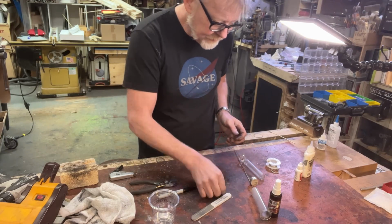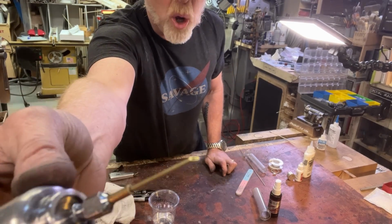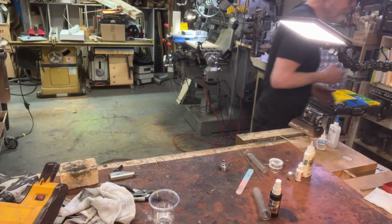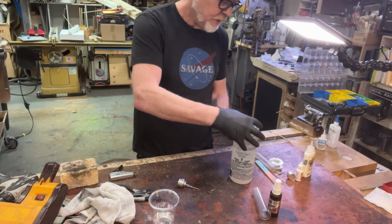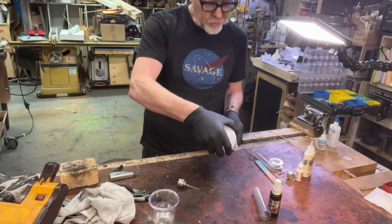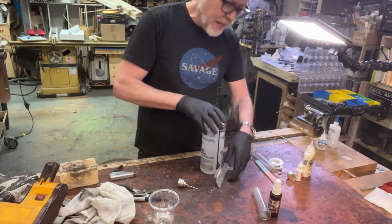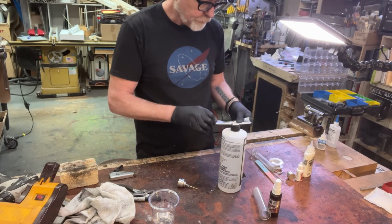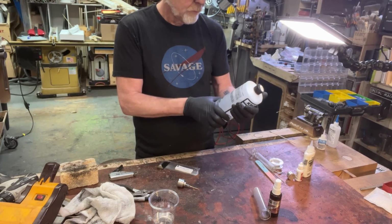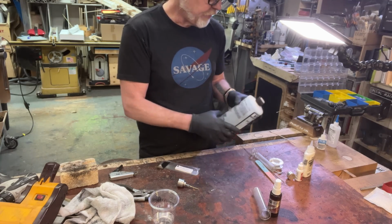This is great. I'm very happy. I want to silver plate this. No, surgical needle is brass. Let's silver plate it. Okay. I have here some silver electroplating solution and a silver anode. And I'll be doing this with 5 or 6 volts. Nope, 2 to 4 volts and a pure silver or stainless steel anode.